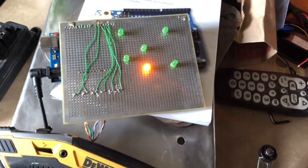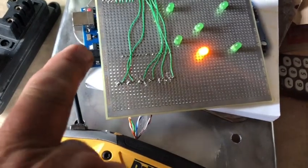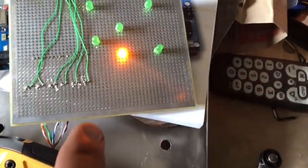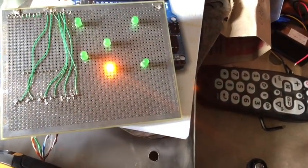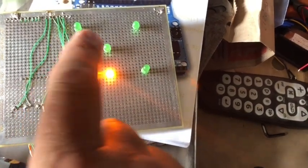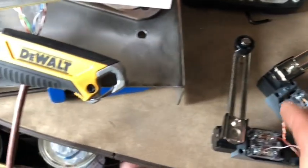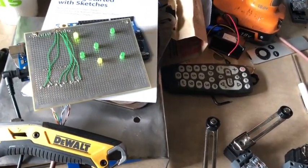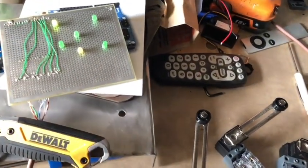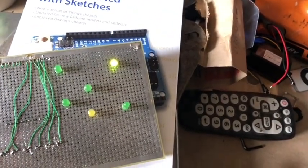I'm showing off my control system, which will track the cars as they go around the track. I'm running an Arduino Uno 3 board right here onto this board. When I actually have my attraction for Halloween, it will actually track around the whole perimeter. But just for the convention's sake, I'm just using the three triangular ones here. I have three limit switches, each corresponding to which position it is on the track. As it dispatches, it will go around the back side, which will turn that light on.